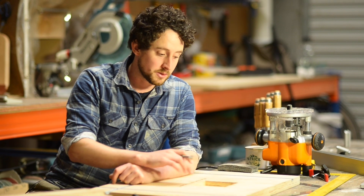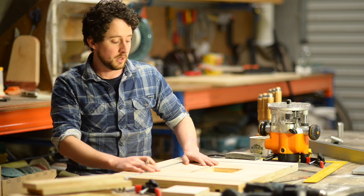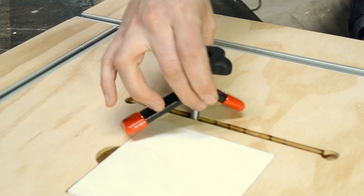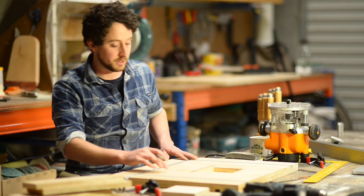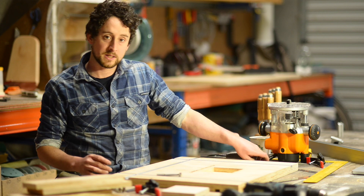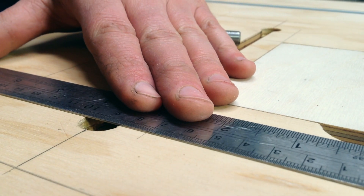You can place one of these keyhole slots wherever you want in this drill press jig. I wanted to place mine pretty close to the dead center where the drill enters the board, because I wanted to be able to clamp small work pieces that I couldn't reach from the other clamping locations. So I've decided to put mine quite close to that sacrificial plate.